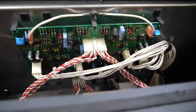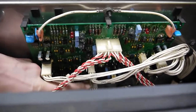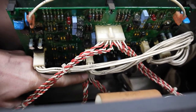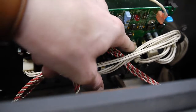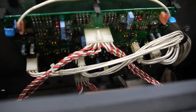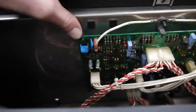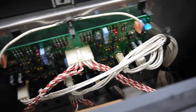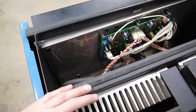So as you can see, we have the two ground wires up top, the IGBTs plugged in here, the MOSFETs plugged in there, and then one, two, three, and four of these white plugs. All six of these snaps you want to make sure are fully gripping the board. With that done, we'll slide the stainless piece back in place and proceed with plugging the front boards in.